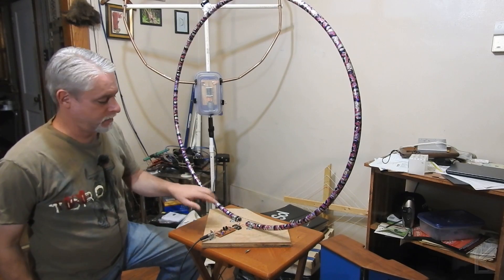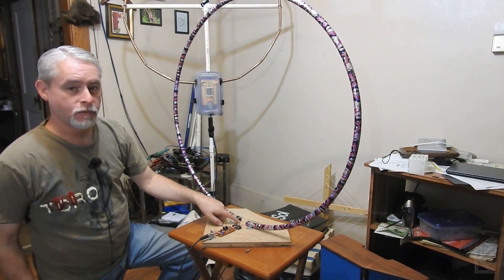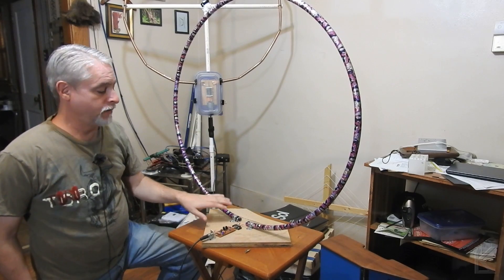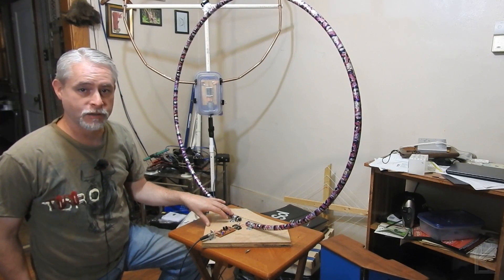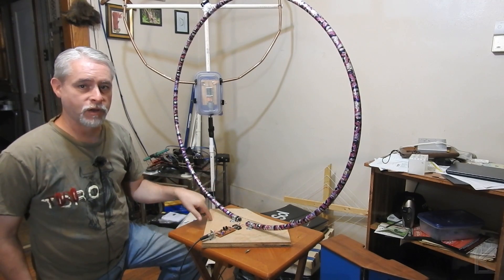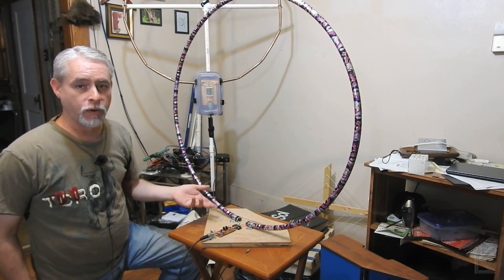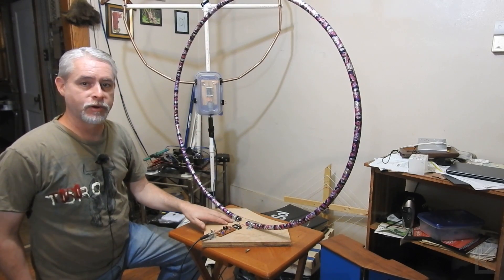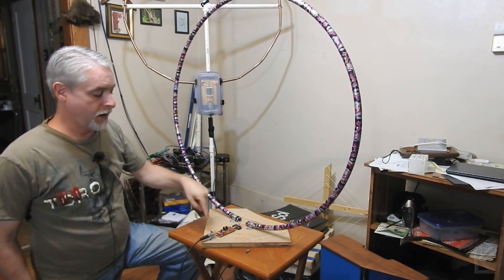So this is the antenna. It's a regular child's hula hoop that you can pick up at Walmart or anywhere for a couple of bucks. I ran a piece of wire — just a single turn of wire — right through the center of the hoop. These are made out of extruded plastic tubing with a split that has a little two-way rubber plug connecting it, and they're usually full of sand or liquid to dampen their motion. You'll want to blow it out or drain it after you find the seam and open it up. Then I fed the wire through it, and down here on the board I have a couple of pipe clamps clamping the hula hoop and the preamp board.